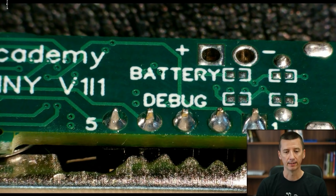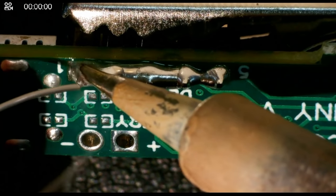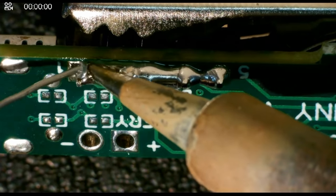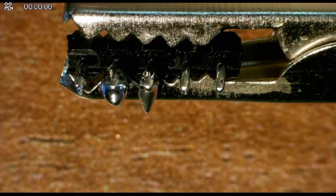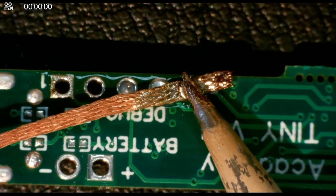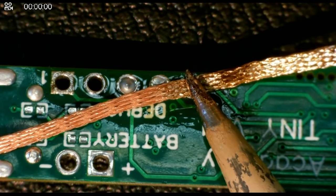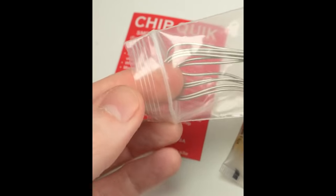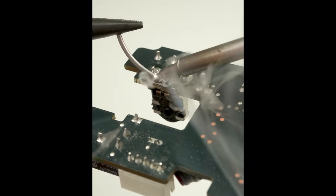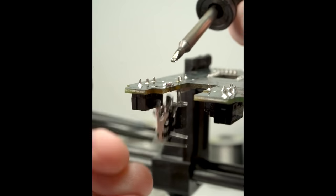De-soldering header pins or multi-pin components is a real pain. One tip I found this week from Robert Ferentz is a demonstration on how adding more solder to rows like these can help extend cooling time and allow the heat from your iron to flow out across multiple pins so that you can gently release them all at once. It's not perfect for every situation — there's a good chance you'll make a mess or fling a hot blob of solder to your face — so proceed with caution, but keep this tip in your back pocket. Colin Cunningham at Adafruit has a similar tip, but adds a special sauce called desoldering alloy. This is a solder formulation designed to cool slowly — you slather it on, heat it up, and you should have an extra second or two to remove your components before things seize up again.